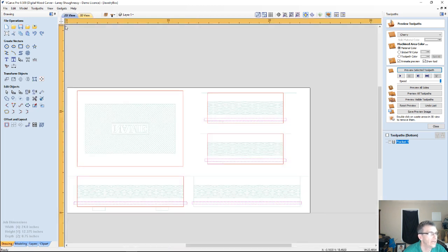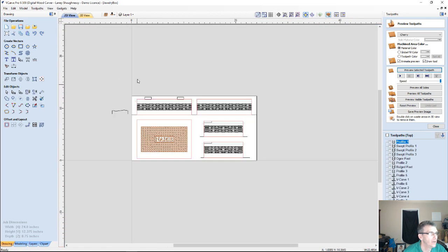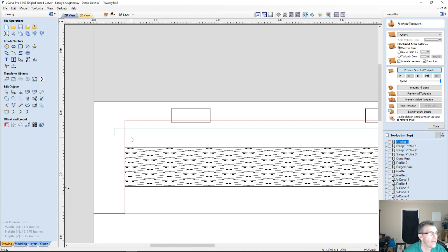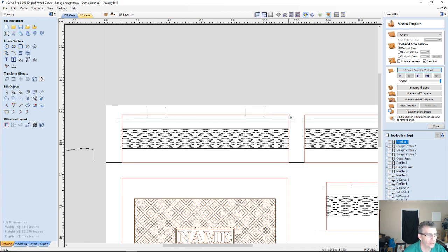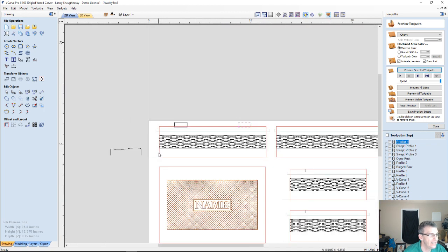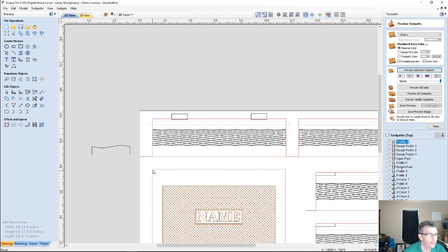Okay. Let's go ahead and get our mortises drawn in. Now remember, if we go back to the front side here, there's no overhang on my lid. The lid is the same size as the box. So my mortise measurements and everything will be good. And this piece here is in line with this part here. They're directly in line with one another.